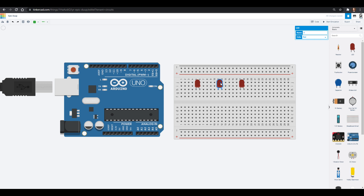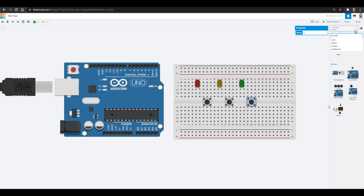We can use a red and change one to yellow and one to green, which will help us remember the different colors instead of just having all red. We'll also put some push buttons in here — make sure your push buttons and your LEDs don't share any column so they're not connected in any way. They need a little bit of space between them. Another fun thing we're going to add is a buzzer, so we can have a different tone on each LED, which is pretty fun.